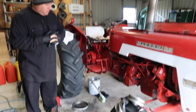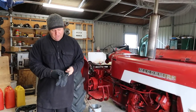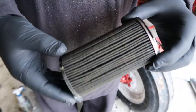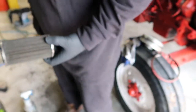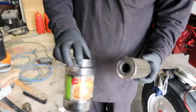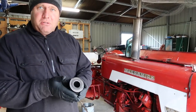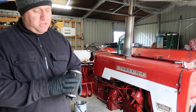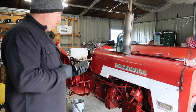As you can tell, I drained the oil and had a little accident, so I used up most of my sawdust. This here was completely clogged — it looks a little bit cleaner now. I soaked it in petrol for a couple of days, then swished it in a jar of petrol and got quite a lot of muck out. Because we're in quarantine I can't get a new one, so I'm going to give it a good cracking of fresh oil and put it all back together.